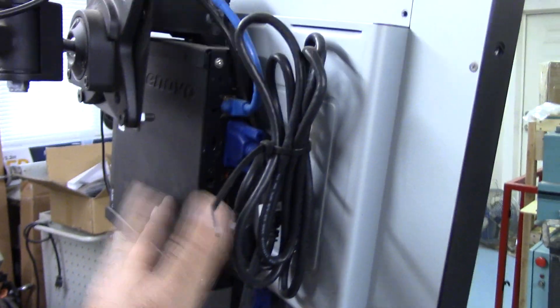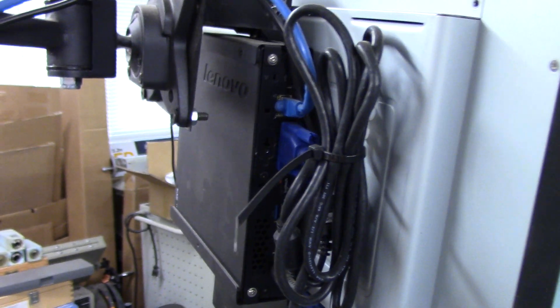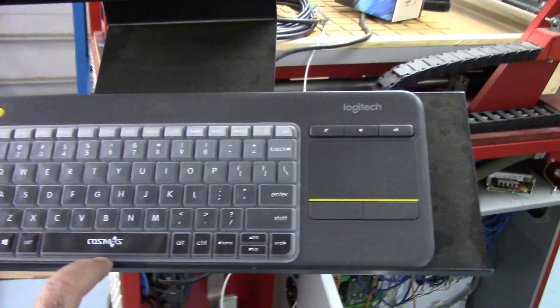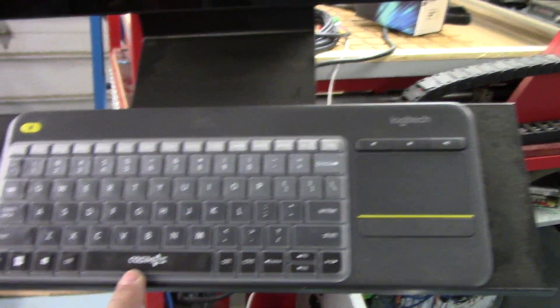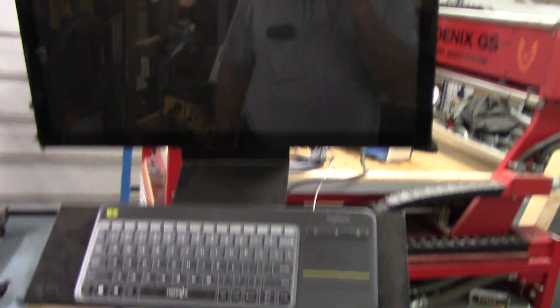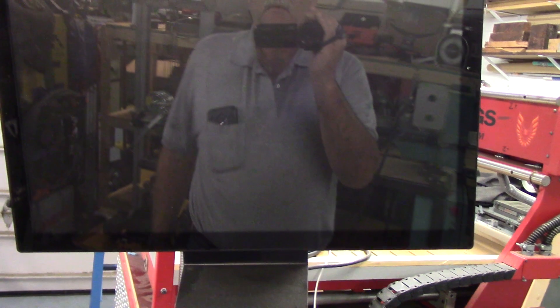I'm using my favorite computers — the tiny Lenovo M92p PCs. You can find them on eBay pretty cheaply; they're usually client computers that come back off lease. I like the Logitech K400 Plus keyboard — it's got a little touchpad, everything you need to interface with the control. That is a touchscreen monitor that came out of a kiosk, so it's an industrial resistive touchscreen. I find resistive touchscreens are far better for the Centroid control — you don't have the chance of it registering a multiple touch when you roll your finger.